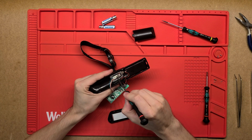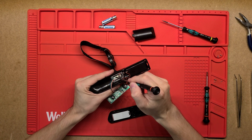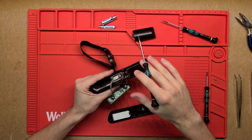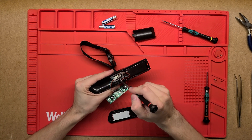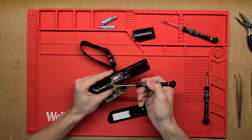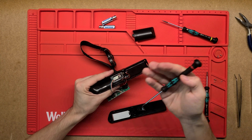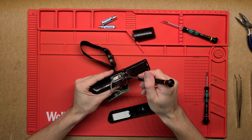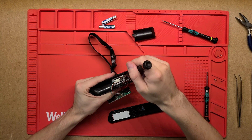Under this silastic here is just going to be a strain gauge. That gauge is just an electrical component — it's got a bunch of little tracks that go around and as the material that it's glued to deflects, it also deflects and just changes the resistance. So these wires here would just be going from the board over to that little gauge underneath, and that would just measure that strain in the material, which corresponds to a pre-calibrated mass sitting on that.